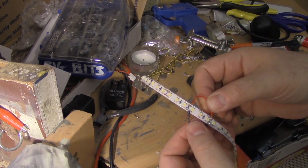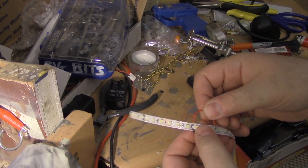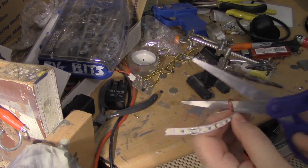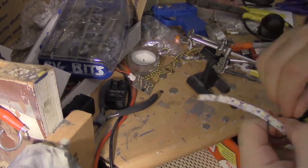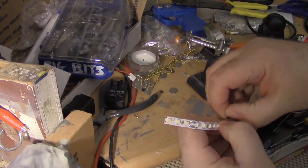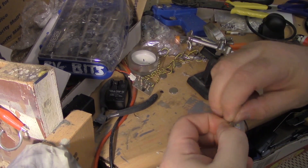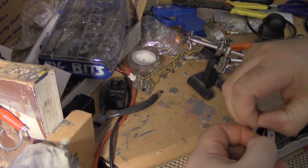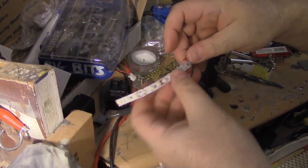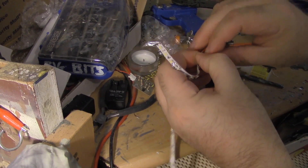You can certainly wind up with a lot of wire on the sides here, which would be too much. However, it's much easier to simply cut this now. I absolutely want to minimize the amount of exposed wire here because you don't want to have a short later on that actually burns it out rather than simply shuts it off.